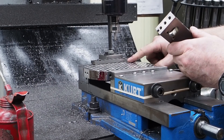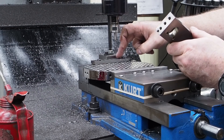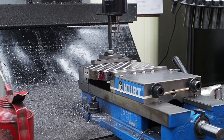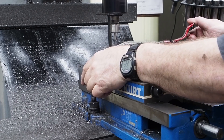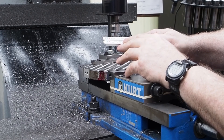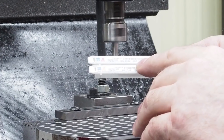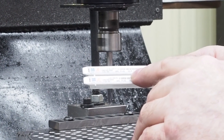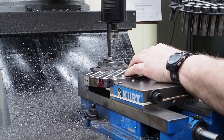There's about five thousandths gap in there. Based on my parallel height, with a 30 thousandth shim underneath, it gives me about the right height. We're going to oil this first row up and get the tap oiled up. By the way, these are an A-Tap. We just bought these — they're about $25 a piece. Everybody I know that uses these swear by them. This will be the first real test I've run them with.